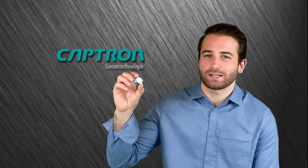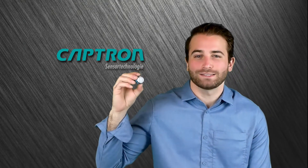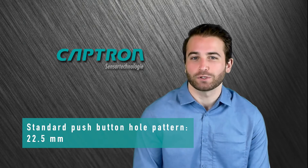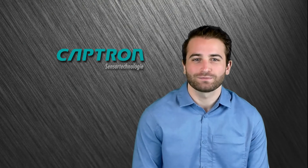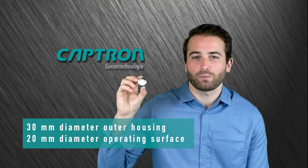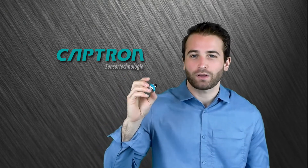The Series 10 has a very sleek and narrow design. Mounting and installing the sensor is very simple and straightforward. The hole pattern is set to the industry standard for pushbuttons at 22.5mm, so it's possible to use existing panel holes for mounting. The switch has a 30mm diameter outer housing with a 20mm diameter operating surface. It's extremely easy to connect the plug-in female M12 connector to the rear of the switch.